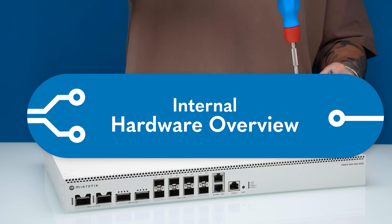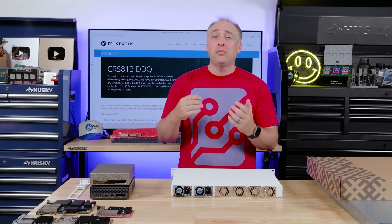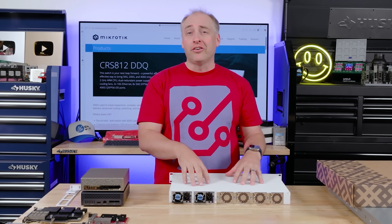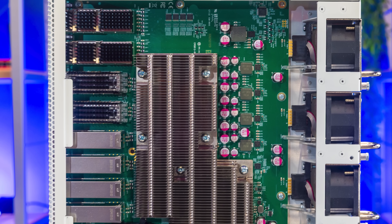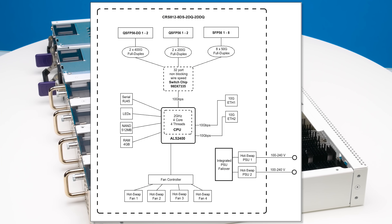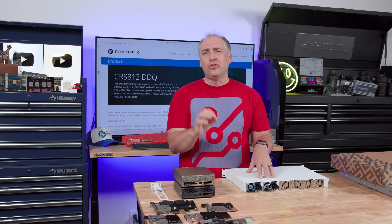Opening up the switch, you'll notice a Marvell switch chip — our big chip — and also a smaller Annapurna Labs ARM chip. MikroTik is using Marvell switch chips here. Broadcom is of course the 800-pound gorilla in networking, but Marvell also does hyperscale switches — we've looked at those before and they go up to 51.2 terabit-per-second switches. The Annapurna Labs ARM chip — which is now part of Amazon, purchased many years ago to make internal chips for AWS — handles our 10 gig networking. This gives us an overall awesome switch design that's really about doing this switch well, not just at the lowest cost.